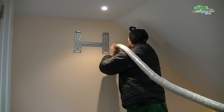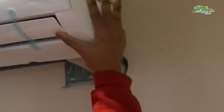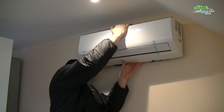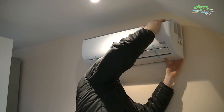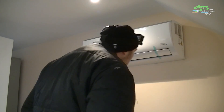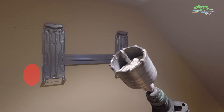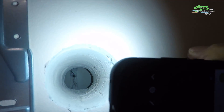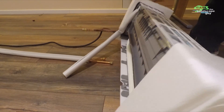In the comments it was criticized that the screw connection of the indoor unit is now inside the wall after installation, making maintenance on the connection difficult. I have to say I had never taken the unit apart since its installation as there was no reason. Nevertheless, next time I would probably take the precaution of laying the indoor unit's connection cable along the back of the unit over to the left, and drilling the hole behind the indoor unit on the other side — which is possible given the construction and if the lines are not too short.